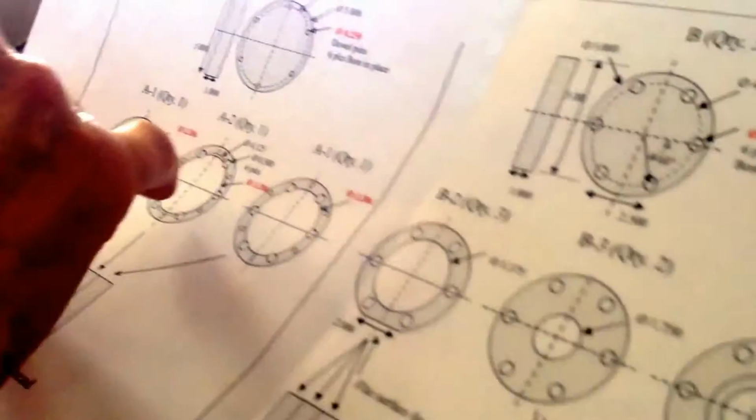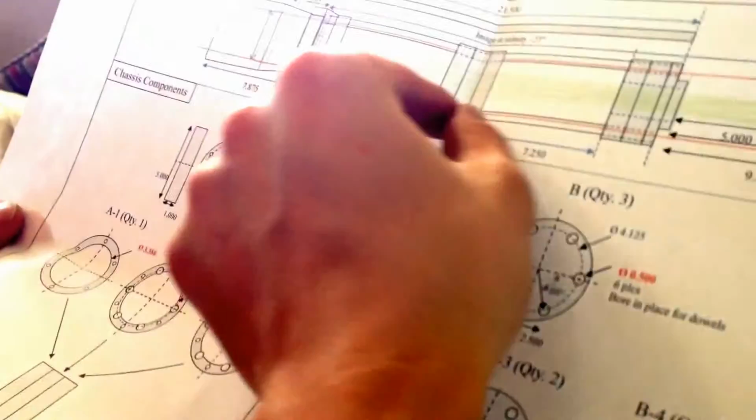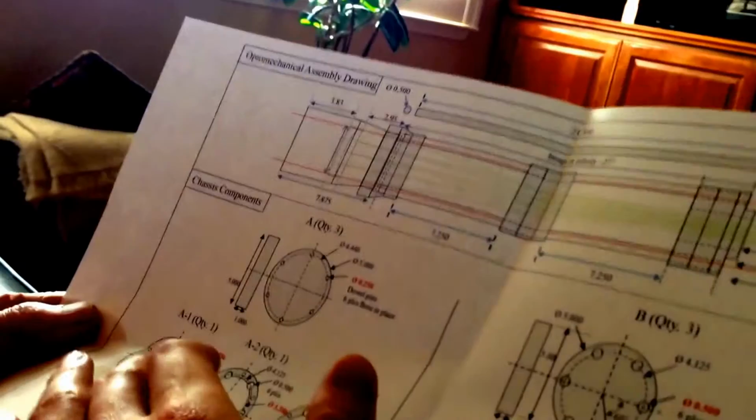But your new design is to cut a mortise and tenon on the outer diameter, and then make keys to join them together. Yes. So you can maybe do that here, and then the dowel pins may not be necessary. Well, I'd still use your idea of dowel pins to hold the three pieces aligned while they're being machined together, because that bore is critical.